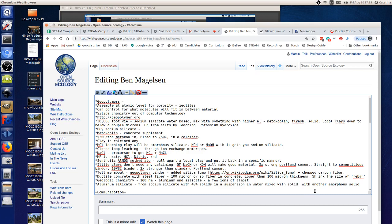I made the sodium silicate myself. I've been trying to source things where I can get large volumes of precursors affordably — for housing and similar applications. I'm using a pumice from Idaho that's about 100 miles away and available in large volumes. It's ultra pure — probably the purest pumice of any resource in the world. It's about 75% amorphous silica and about 15% aluminum content. I dissolve that in a hydroxide solution to make potassium or sodium silicate, then combine that with additional pumice and metakaolin, mixing particular atomic ratios and molar concentrations of alkali in water to control what happens.